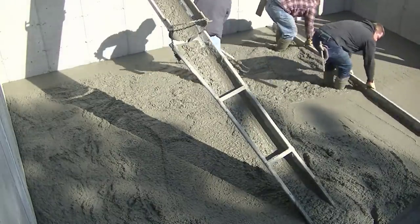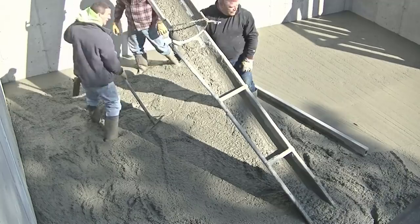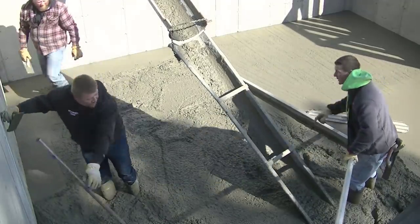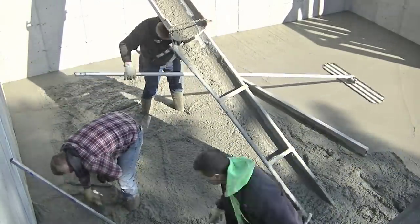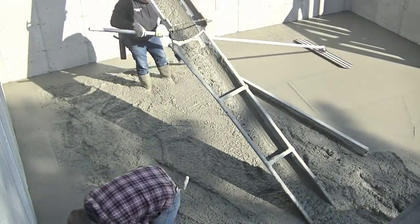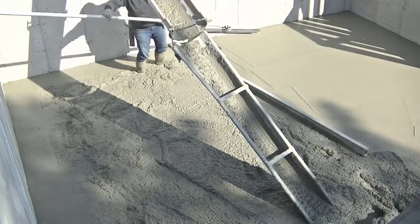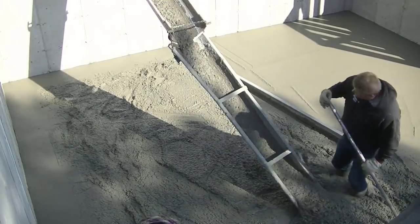Being on styrofoam helps too — it helps hold the heat into the concrete a little bit longer than if you pour right on cold ground. Most of the jobs we do this time of year have styrofoam under them here in Maine, because we have so many freeze and thaw cycles between November and March. Most of the floors and slabs we do have some styrofoam under them. I don't know why they decided not to put styrofoam under that thickened area in the middle — it probably had something to do with the weight going on it. A lot of times I don't get into the design of the floors; I just get into pouring and finishing them.